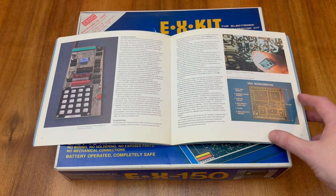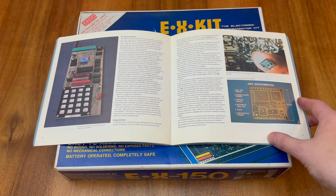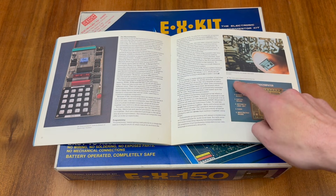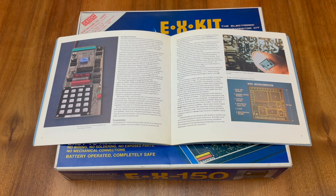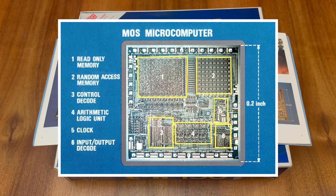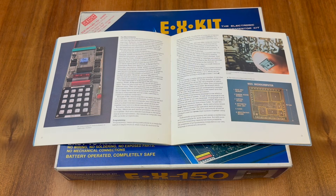The error I was referring to is actually in this picture just here on the right-hand side. This image is labelled as the main part of Intel's microcomputer, and the back of the book is attributed to Intel. However, this slide is actually produced by Texas Instruments, and as you can see by the read-only memory section here, it is actually a single-chip microcontroller. I instantly recognised this particular slide, as the die in the picture is actually a TMS1000 series chip, and regular viewers of my channel will know that particular chip comes up quite frequently. It may make a cameo later in this video as well.